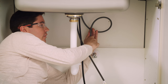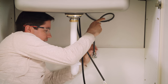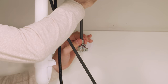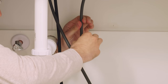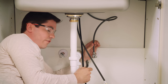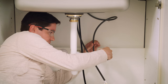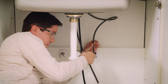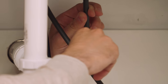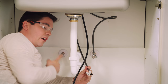You can see here we're going to be a little bit tighter, so the alternative is to make more of a spiral pattern and then bring the supply line down to your stub-out, beginning to hand-tighten that nut onto the top. Once you've got that hand-tightened down, take a wrench and give it one more full revolution. You'll notice on the nut, one of the faces has a little diamond pattern — that's how we can track to make sure we make one full 360-degree revolution. Tighten that nut up and we should be nice and connected. Repeat the same steps for the hot side on the other stub-out.